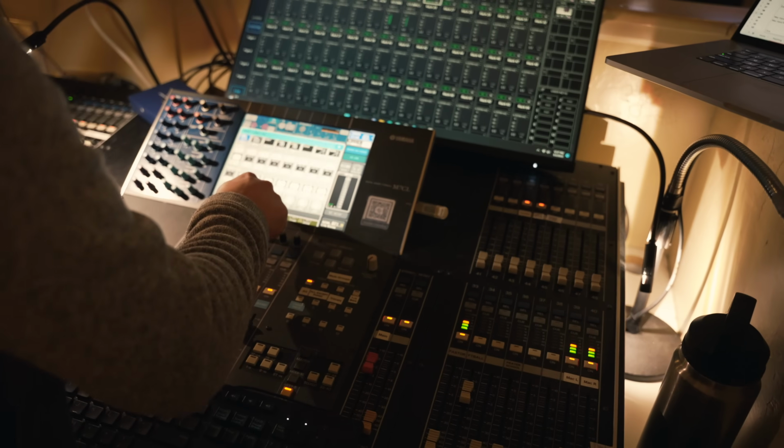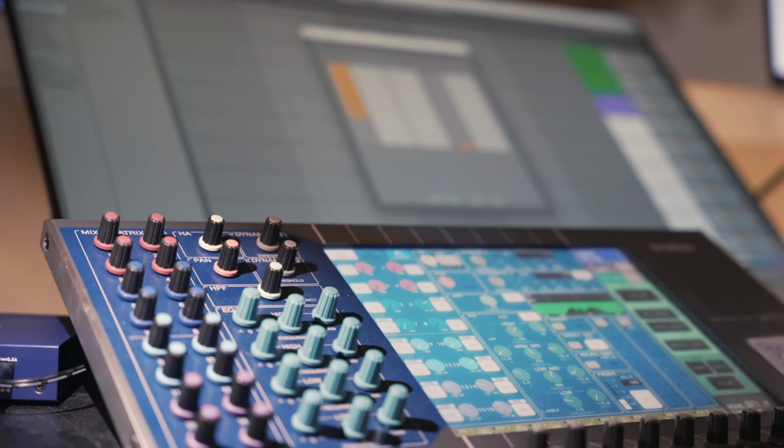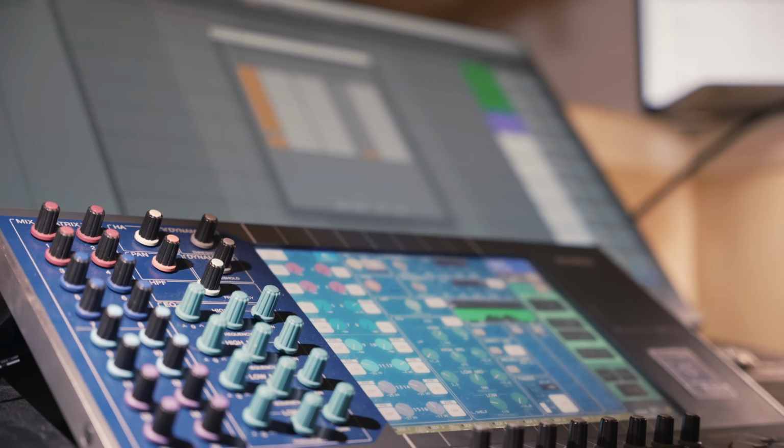Then the receiver had a spot that you could set the gain. After that, it hit the console preamp, another spot you can have gain, and then on the channels, the compressors being used on the console itself had really compressed and then a lot of makeup gain. After that, it went to Waves SuperRack, where the input of the SuperRack was cranked, processing happened, and then there was more gain after the Waves SuperRack output. And then you got your fader placement of all your individual channels, your master output, and then it goes to the amplifier.